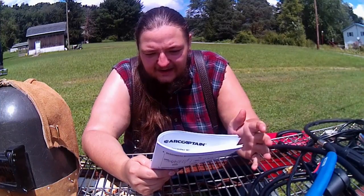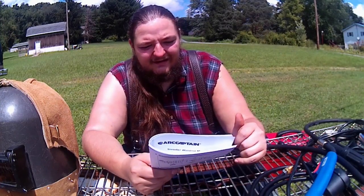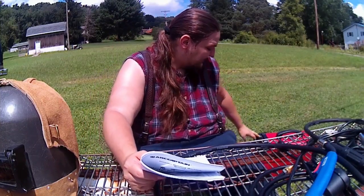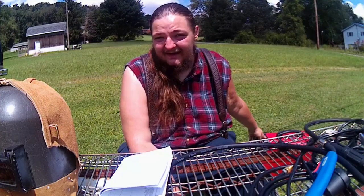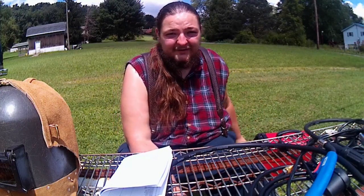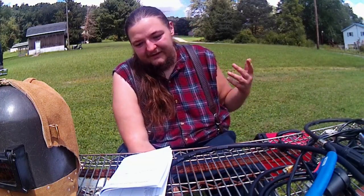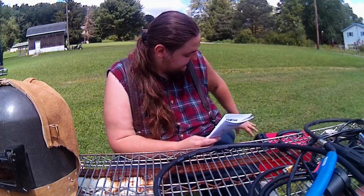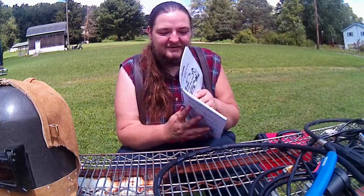For the lift arc TIG, you're going to have between 20 and 200 amps, and that's at 60% duty cycle. So technically, in a way, you could trick this machine into letting you run stick electrodes on the full 200 amps. You put it in the TIG setting and just switch your leads around. Instead of running DC negative for your electrode on TIG, you hook in your ground there instead, and put your stick lead where the ground was supposed to be hooked up. You just reverse the polarity and run it, and in theory, you'd be able to run it, unless the machine has some kind of know-how to stop you, but you could. But that 20 amps isn't really going to make a huge difference.